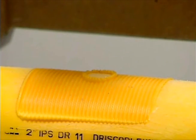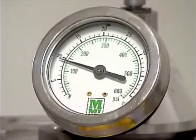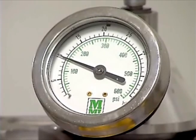Quickly inspect the melt on the main pipe and the fitting base. The surfaces should be completely melted, and within 3 seconds, move the fitting against the main pipe and apply joining force.